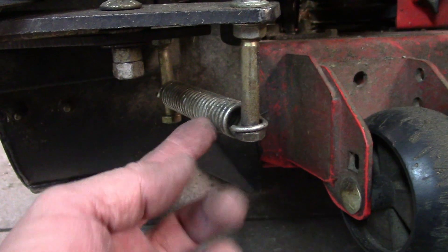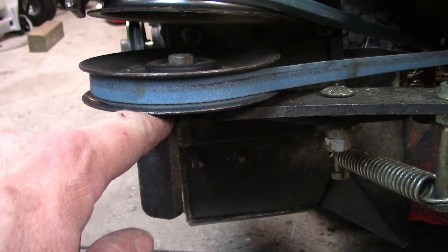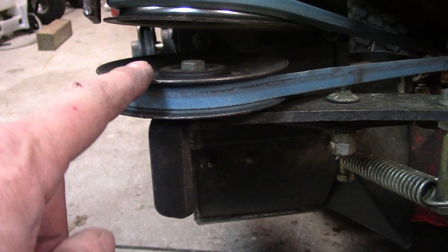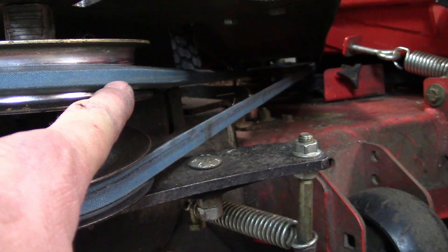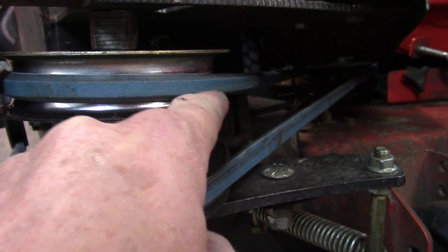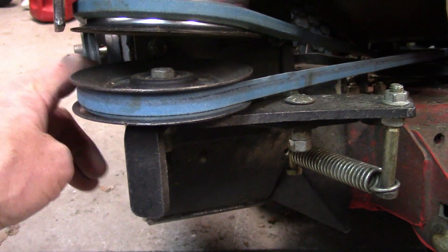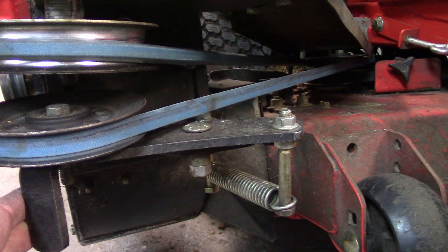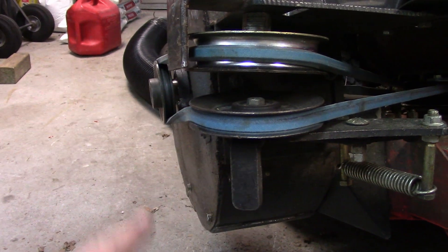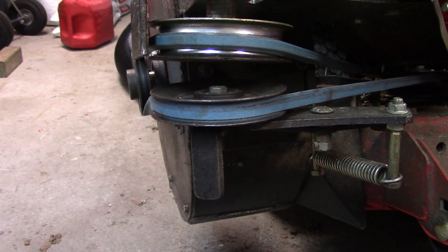So I'm going to put shorter bolts on here to get the spring up higher, so it maybe won't pull down as far. And like I said, I'll just bend this bracket up just a little bit, because everything else is good except for this right here — this is lined up good, this is pulling right in the center of the pulley, it's not touching anything. The whole time I was running this I put a 100-inch belt back on it, put more slack in it, and it's not throwing a belt anymore, so I think a lot of it was pulley alignment. Some of my error and some of their setup error — but that's how you learn things, trial and error.